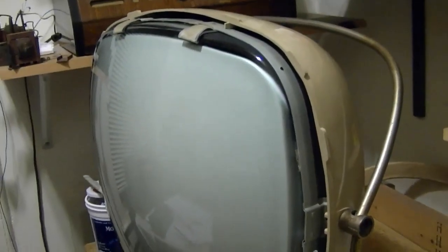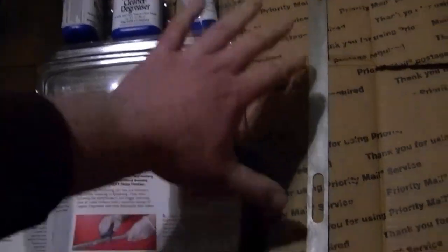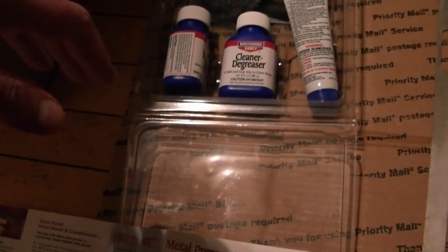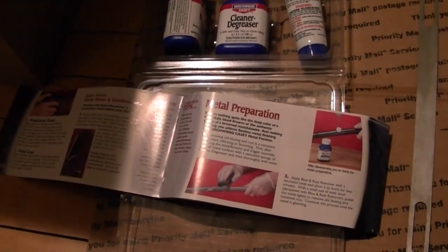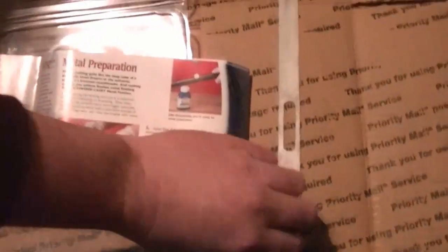Remember it was all rusty. Here's the metal strap that holds the front cover on. If you recall it was quite rusty on both sides, so I used some rust remover on that. Got it all removed but now I want to treat it with something so it doesn't start rusting again. You can see the steel was originally treated with something that turned it black and provided a protective coating. So that got me thinking - I've had this gun blue kit for a while and I've never had a chance to try it, so I might as well give it a shot now. I looked through the instructions briefly and the first steps are to clean it and remove rust. Well I've removed the rust pretty well but I haven't cleaned it, so I'll give it a quick go over with this cleaner degreaser and blue and rust remover. I'm just going to do the section where the bare metal is.